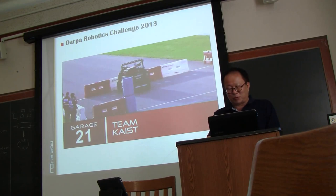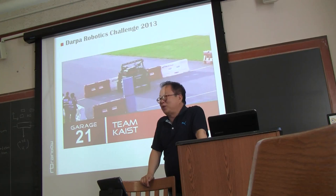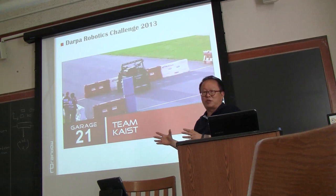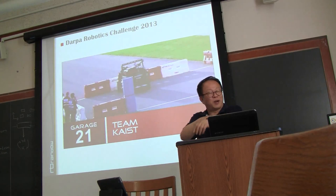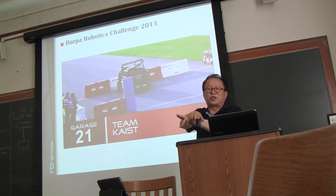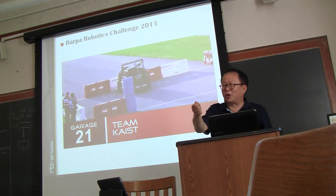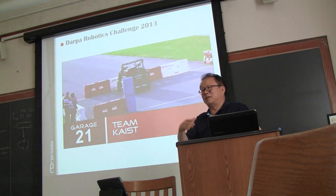And the lessons, okay. We should have a much more robust robot system. We believe that the robot itself was okay. But we added vision and other things and very small cameras. We put cameras into the computer, and the network problem is, for example, a USB port was dead and the other ports changed sometimes and killed the computer itself. So we experienced lots of different problems. Also a network problem: we take out a LAN cable and plug it in again, and then the computer dies. So we struggled a lot with system stability problems.